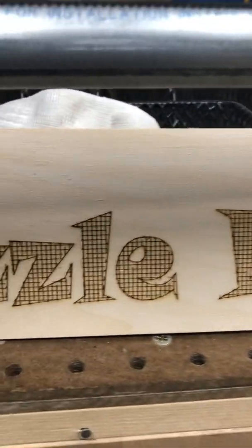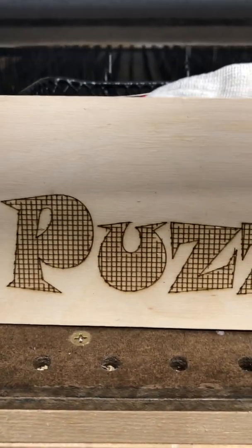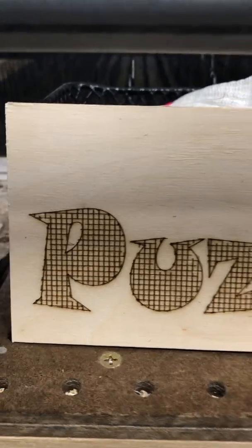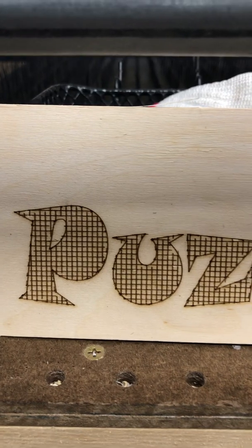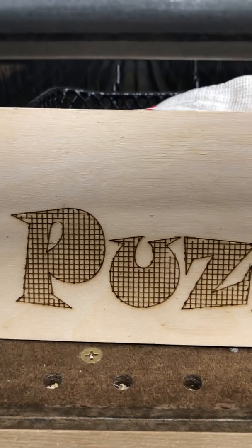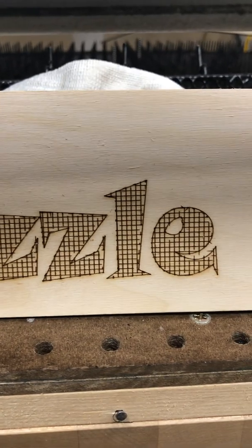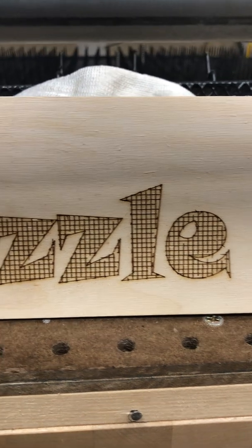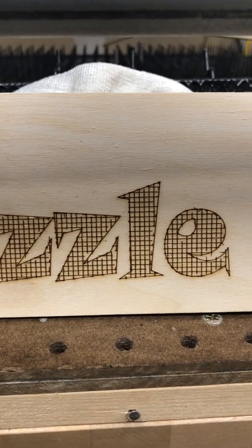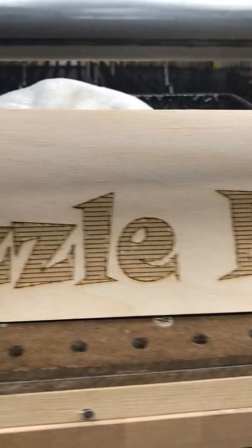This example shows what it looks like without the fix. When you do put in the commands, you get a nice grid inside the letters with maybe half a percent of small artifacts I'm not sure about yet — but it is much cleaner. The G4 command is your pause command; use a capital P followed by a number of milliseconds to stall in areas where it's taking off too fast.